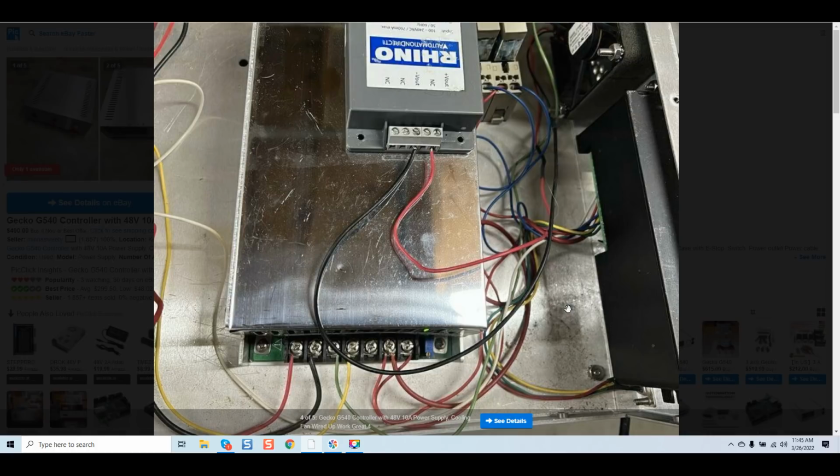This is what I want to ask you, because what you're looking at here is a complete mess. And anybody that's been in electronics will tell you, I mean, we see leads not even fully inserted in the terminal block. And then, of course, here, we don't know what gauge wire he's using. We don't know what's connected to what or not connected properly. We see no grounds or shields or anything going on in this system.